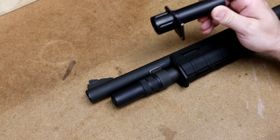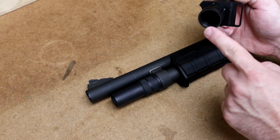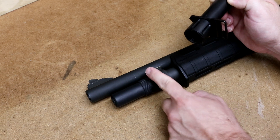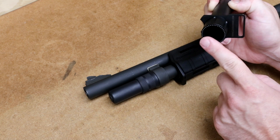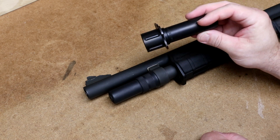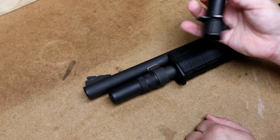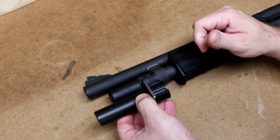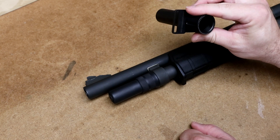They will add a wave spring between the extension and the barrel, which makes the knurling or dots at the end of the extension completely useless — it's being held on just by that spring pressure. The spring kind of sticks out around the extension, which I don't think is very attractive, and it's not the way it's supposed to attach to a shotgun. I don't know why they don't address this and machine it like the Mossberg extension. So for my personal opinion, if you are looking at the SJ Hardware Plus 2 magazine extension for the Mossberg 590A1 with the 18-inch barrel, don't buy it. It has so much potential — it's finished nice, I really like the sling swivel, it looks great, wonderful in concept — but they don't machine it correctly for it to work on this shotgun. I hope this helps somebody.